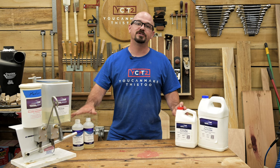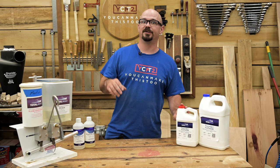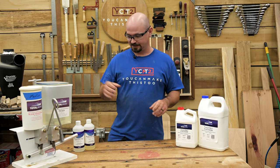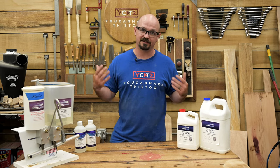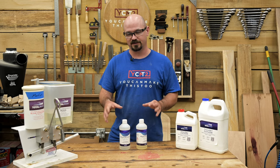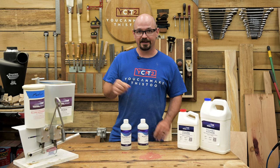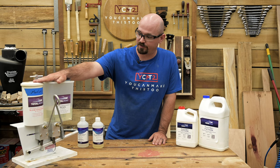The first thing: using the wrong epoxy for your project. I have a very in-depth video where I go super into the weeds on the right epoxies to use, but I'll keep this quick. The basic thing is to look at the name of the product and the application — if it fits your application, you're good; if it doesn't, stay away from it. Maker epoxy is made for doing art resin stuff, very similar to a bar top epoxy — it's meant to be poured very thin, cured quickly, and used as a top coat.